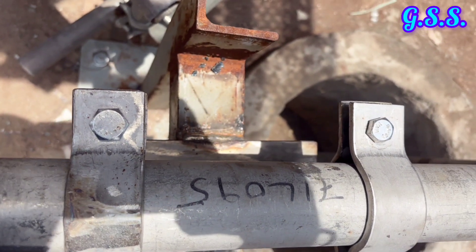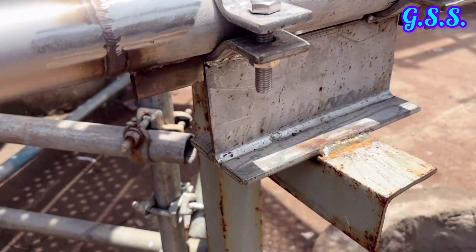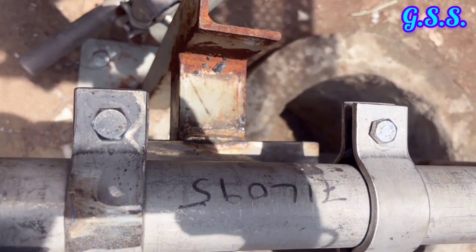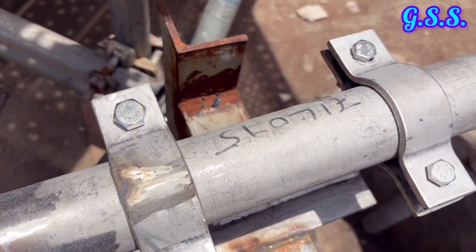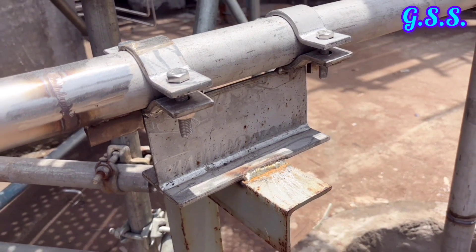This anchor support will not have any linear movement or rotational movement in X, Y, Z direction. That's why in X, Y, Z plane, both forces and moments will be generated in terms of FX, FY, FZ and MX, MY, MZ.